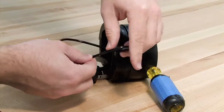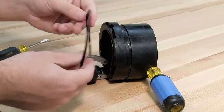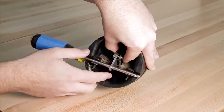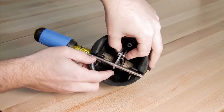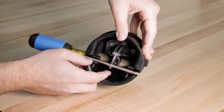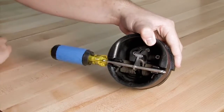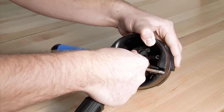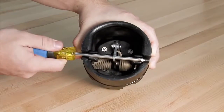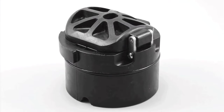Inspect the O-ring. If it's damaged in any way, it should be replaced. Once all check components have been inspected and replaced as needed, reconnect the structural members with the pin and the E-clip. Carefully remove the screwdriver and prepare the check for reinstallation by lubricating the O-ring with an FDA-approved lubricant.